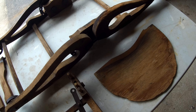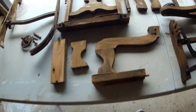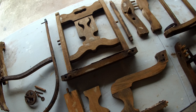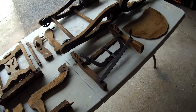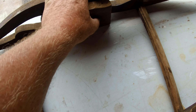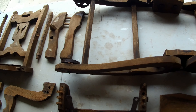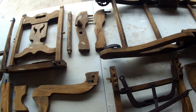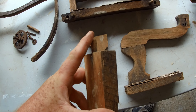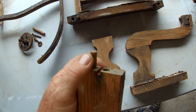Next time we tune in we'll be in Canada, and we'll continue there. I'll take these washers off — they've been filed over and buried — so we'll just file those off. Then we'll pull it right down, clean everything up, re-glue and re-clamp everything, and put new dowels in where needed. Some of these dowels have got to be at least 130 years old, so they've held up pretty well.